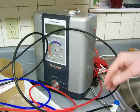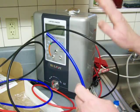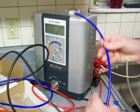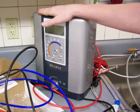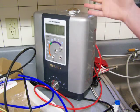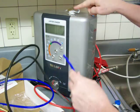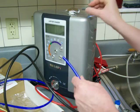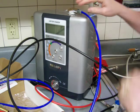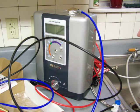These hoses can be cut — you'll be installing this under your sink and you want it customized to what you need. You'll need a helper and you'll need to figure out how it will be positioned under your sink. You'll probably want the Melody itself to be pretty close to your cabinet door so you can reach in and push the button to switch settings. The last hose hooks in with a connector piece that screws in tight, then you just push the hose in like all the others.